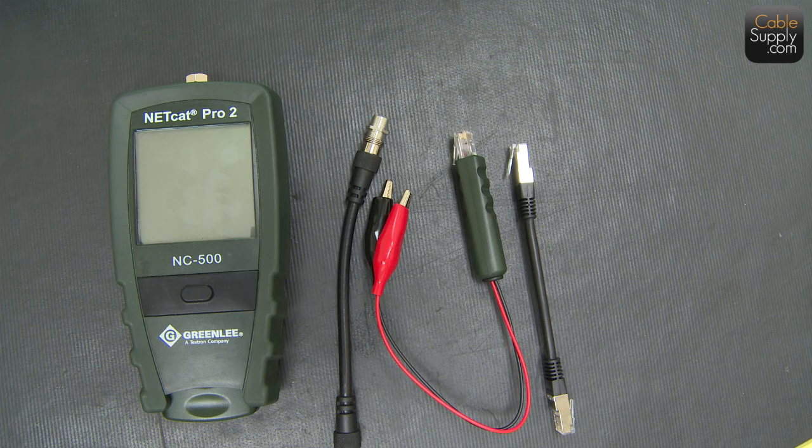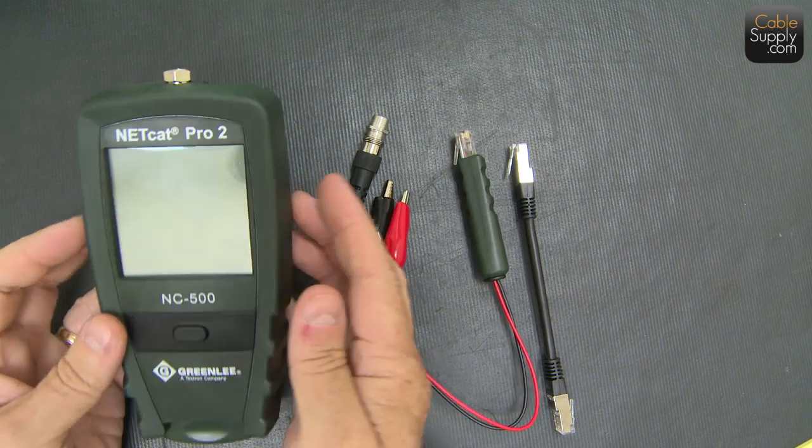It identifies active network devices — it'll identify if you have a PC plugged into a hub, and I'll demonstrate that shortly. It displays network device capabilities, which is really cool. It can test patch cables and give you a wire map — telling you if there's a cross pair or if it's pinned out wrong. This tester detects opens, shorts, reversed pairs, cross pairs, and split pairs. You can also buy cable identifiers so you can identify more than one pull at a time. It's also compatible with different tone probes used in the industry, so you just need the probe — saves you from carrying an extra toner.